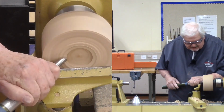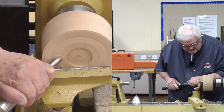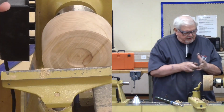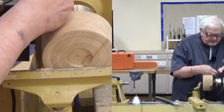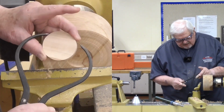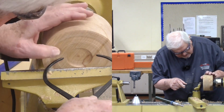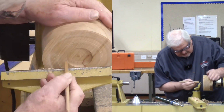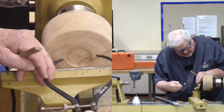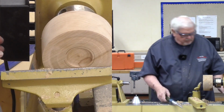See this surface flat. Let's just gauge real quick what size this plug is. It's about there. I need to gauge how big this hole really should be. I want to check it one more time. So here's the plug. Set my calipers to roughly that diameter. And my goal here is to be sure that it's not that big. I can actually put a pencil mark there if I wanted to. So if I don't go outside of that, I'm going to have plenty of wood to shape up the inside for this in a few minutes. Okay, that's just a reminder.